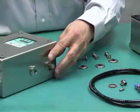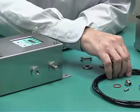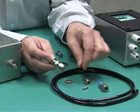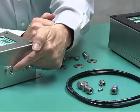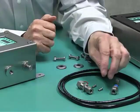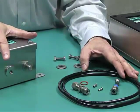In order for this to work, you have to measure differential pressure, and that's done through this port. On the external mount, you have to reference the inside pressure, which is the higher pressure. We include mounting hardware for the reference pressure — a bulkhead fitting with an O-ring to provide a seal. This goes through the enclosure, along with a fitting that screws onto this port to connect the 5500 to the enclosure. We also offer poly tubing along with inserts that go into the ends of the tube, providing strength for the ferrule-type fitting for easy mounting. You can also use stainless steel tubing if you wish.